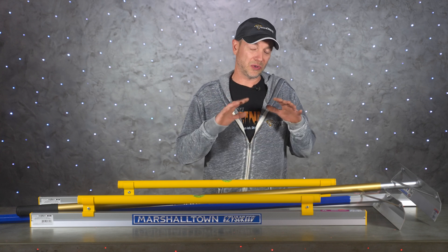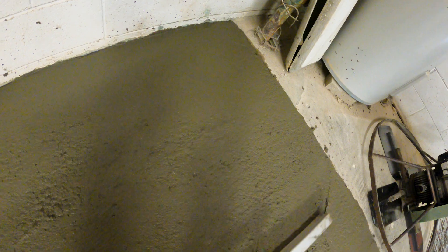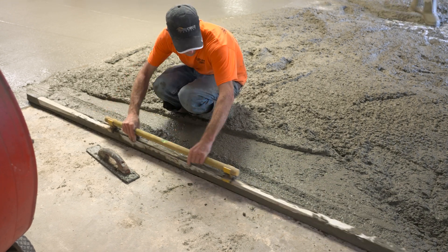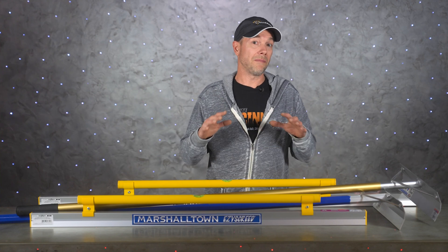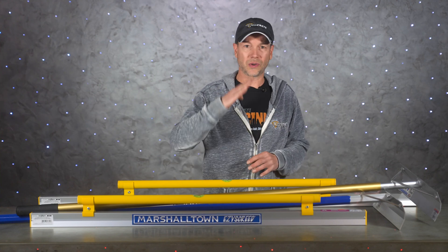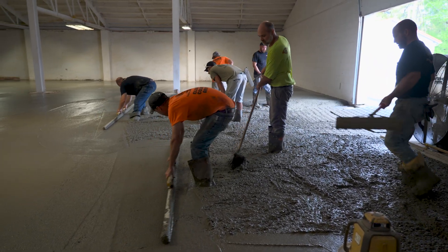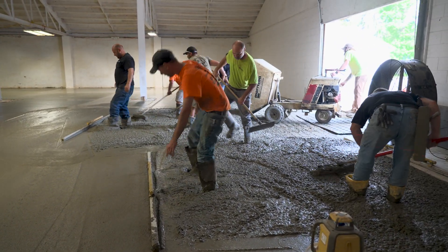When it comes to pouring concrete, one of the most critical steps is screeding. You may have heard this referred to as straight edging or rodding, but no matter what the term, you can form your slab up perfectly and have that grade exactly where you want it, but if it doesn't get screeded off right, all that work is for nothing. Good straight edging is what makes a flat floor flat or creates pitch on an exterior slab so water drains off. There is nothing worse than a low spot that holds water or a big dip or hump in what was supposed to be a flat floor.